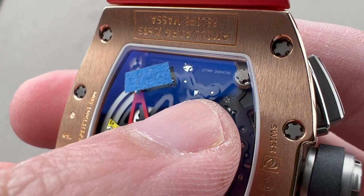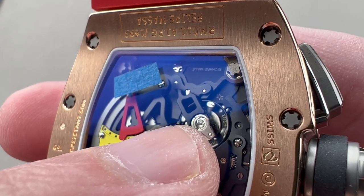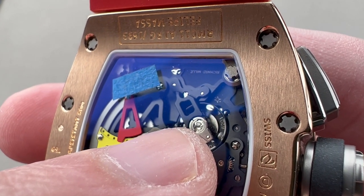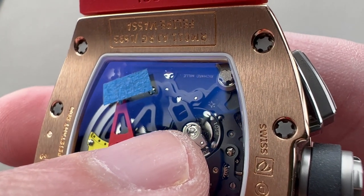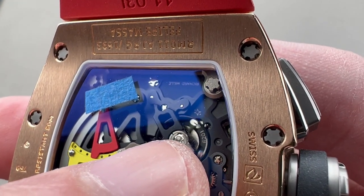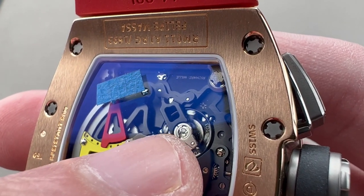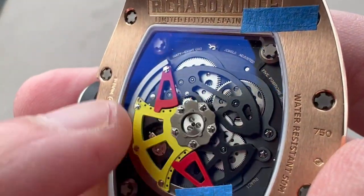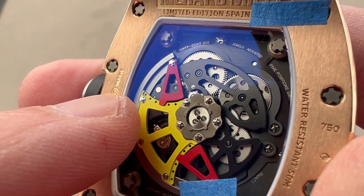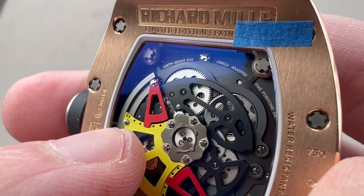You can see the little Vacheron star on the base plate right there. A clear sapphire has been used as the capstone and the cupstone for the balance staff, maintaining the monochromatic technical look. You can see that this was born as a Valjoux 6201 movement. It beats at 4 hertz, is free-sprung for durability against shock, and has five-position adjustment — the high horology and chronometer standard. It's all made of grade five titanium to reduce the mass and susceptibility to shock, as it is a modular complication.